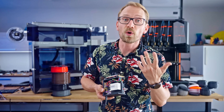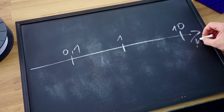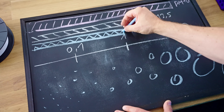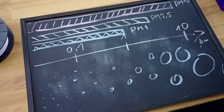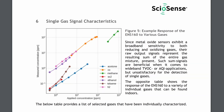These are all relatively low-cost sensors, so the particle sensors can't distinguish particle sizes under one micrometer — we only get figures for PM10, PM2.5, and PM1. That is still valuable information. The VOC sensors don't report on specific VOCs; there are thousands of them, so they just give a total amount of everything they can sense. The Siosense and Bosch sensors have different sensitivities to different VOCs, so that could be interesting.